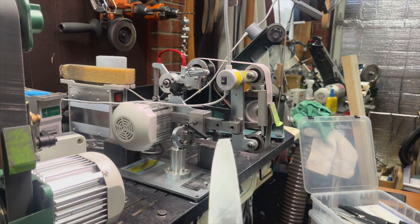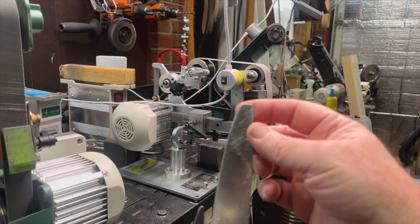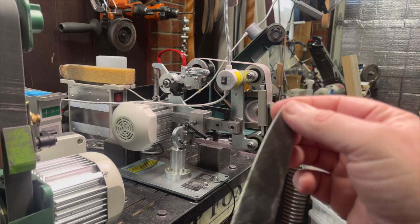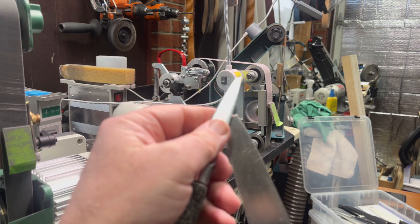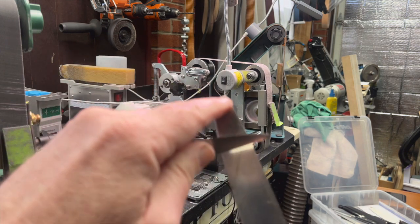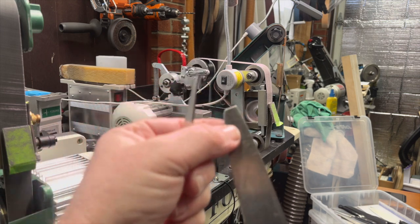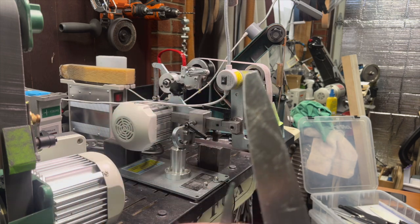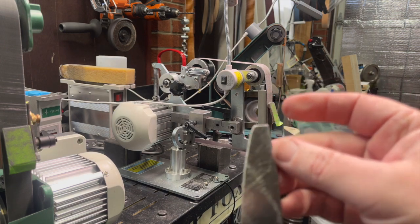And you've often heard me say about knives that sometimes you'll hear me say, well, this knife has a fat tip, or this knife has a fat heel and needs some more grinding. Well, one reason could be if someone corrected a broken tip and didn't properly thin the knife out, you can get it really fat up in here and you'll notice it. It could be fat and it just doesn't, when you're sharpening the whole knife, it just doesn't come out correctly. So you might have to thin that area.